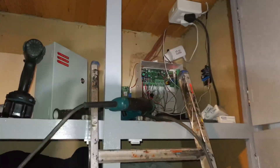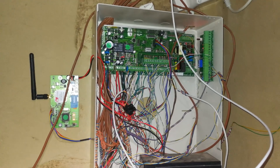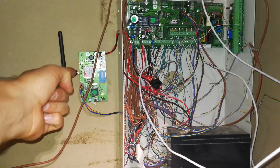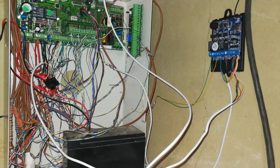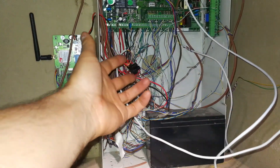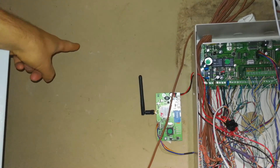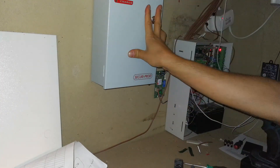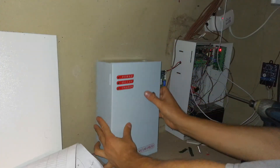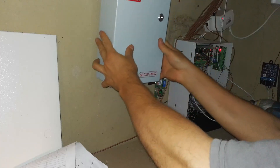The installation location is in the top of a cupboard, since many people keep their alarm systems there. What you're looking at is a 64-channel alarm system — half of it is on the other side of the house — along with an SMS communicator and a remote control module on the wall. I want to install the backup power supply just above these. The plan is to install it higher up so the LEDs are visible from ground level, otherwise the end user can't check if power is on or if it's charging without getting on a ladder.